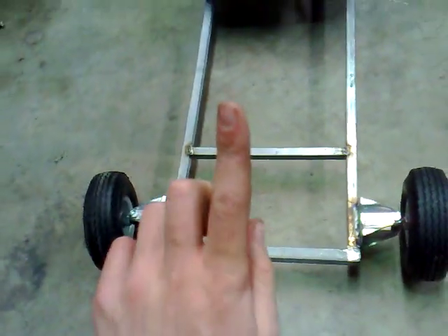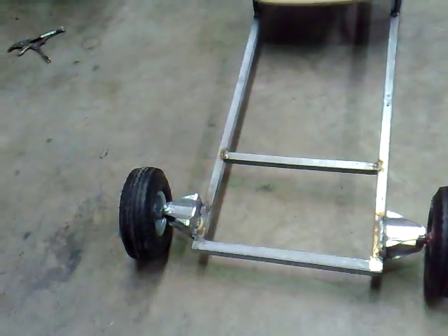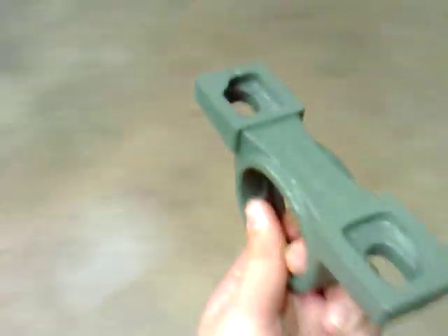The steering wheel column will sit up like that, and before it hits the steering wheel shaft there'll be adjusters on either side so you can adjust the wheels so they're fully straight. On the back, I still have to put the bearing holders underneath - here are the bearing holders. These are cast iron so you cannot weld them.